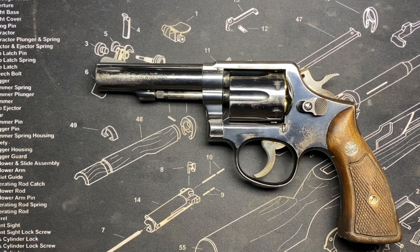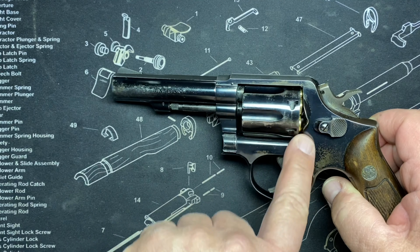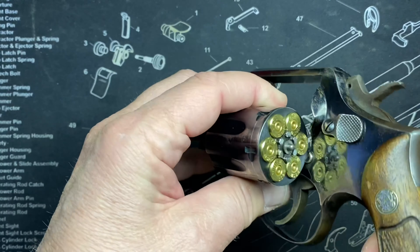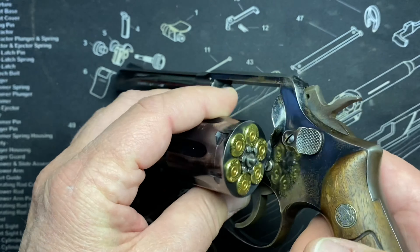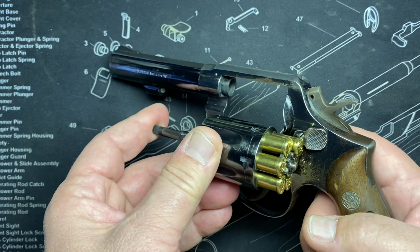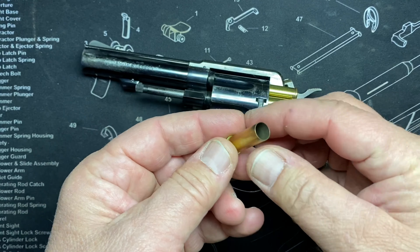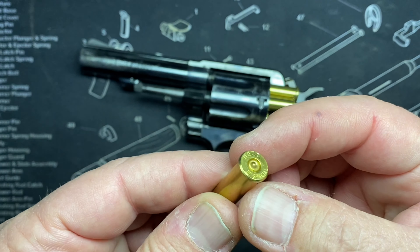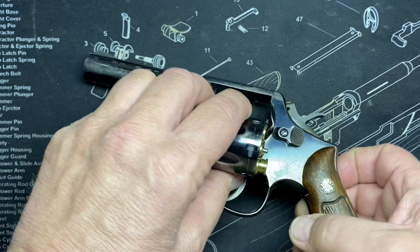These aren't loaded — I just keep the shell casings from the last rounds I fired in here so I can check them out. I want to see firing pin depth and the hits on the primers. Look at that — that's beautiful. I just want to make sure nothing's sticking; these are nice and loose. No excessive blow-by, and more importantly the case rims aren't tearing, no bulging, nothing weird going on. These are awesome.